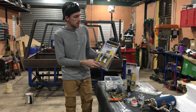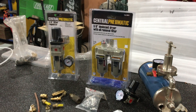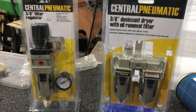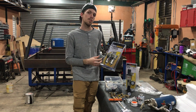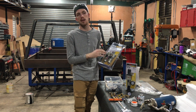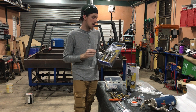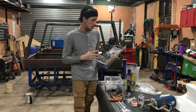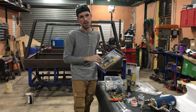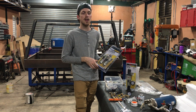I've been using this for a while and just got another one for a new setup. This is an oil separator filter and a desiccant dryer. It uses desiccant — little bead pellets that start blue and turn pink as they absorb moisture, becoming fully saturated. You don't have to throw them out; you can put them in a dehydrator or oven at the right temperature, dry them out, and reuse them, saving money over time. It also removes dust and contaminants from your air supply or compressor tank.